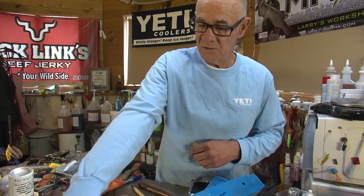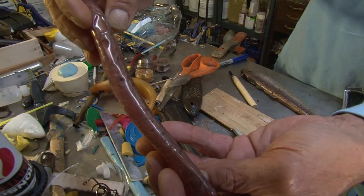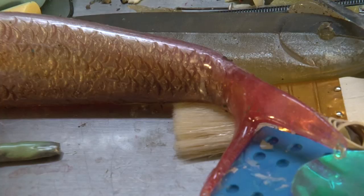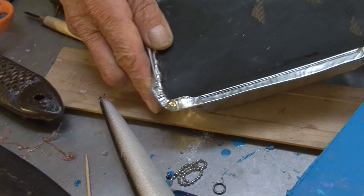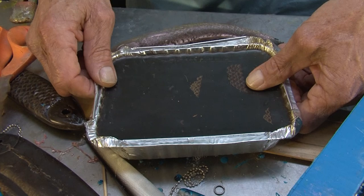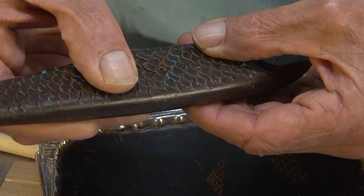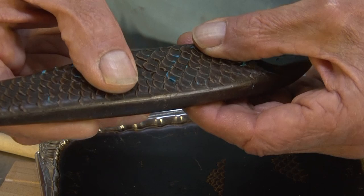If I want to, after this step, I can dip it in clear and wind up with a slightly slicker finish. The scales got a little bit deep and actually got pulled apart with the mold. To solve that problem, had I done this — just sort of poke these down — see how these are lifted up — just sort of flatten them out, and I think the next one will come out even better.